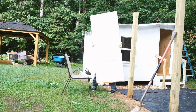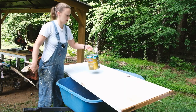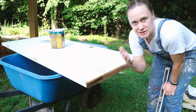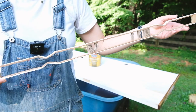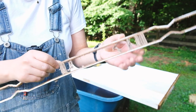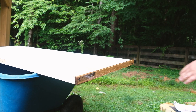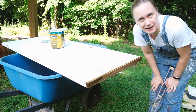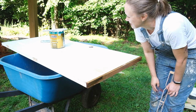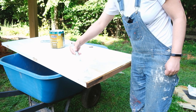The door has had some minor surgery — let me show you and then I'm going to paint it. Exterior semi-gloss. This is an interior closet door we bought, and we needed to chop it down to fit in the Hobbit house. The reason it's interior is because we were looking for a narrow door. Inside we chopped off a little bit more since it's hollow and needed to be capped. We put sawdust mixed with epoxy inside, then capped it with a piece of white oak that also has epoxy on both sides to seal any gaps. Epoxy is everywhere. Then of course we need paint — putting on a lot of exterior semi-gloss paint on the main parts.